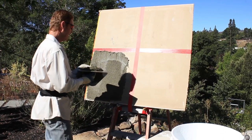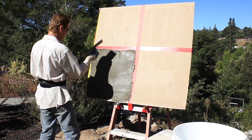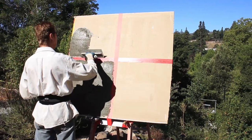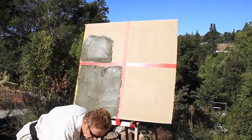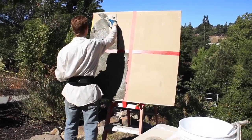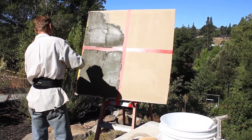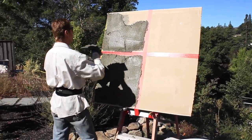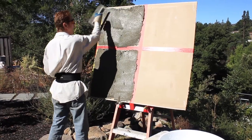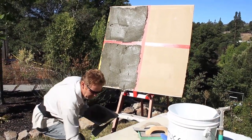What happens if you use a steel trowel with a scratch and brown? It cracks. Is that normal? Yes. That's why they put two coats - they do a scratch coat and allow it to cure, then they come with a second coat, and that also is allowed to cure. During the drying process, which is 48 hours for scratch, we usually go a week minimum to two or three weeks in the winter to allow the brown coat to cure if we're going to do this color coat. So I'm going to get these coats on, put my scratch marks, allow that to set, then come back and do the follow-up coat.